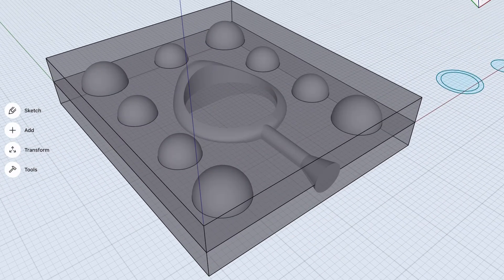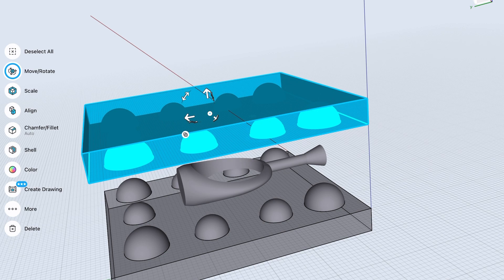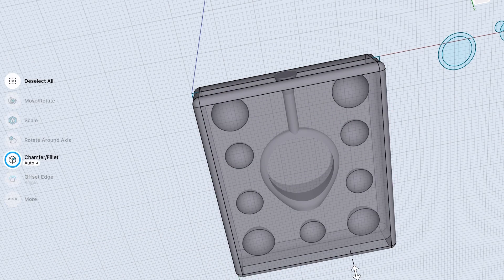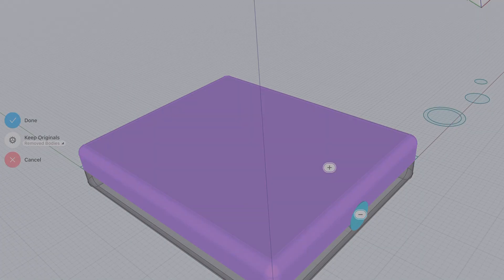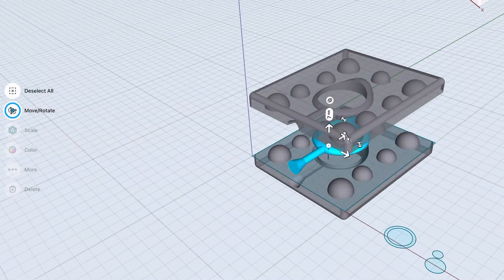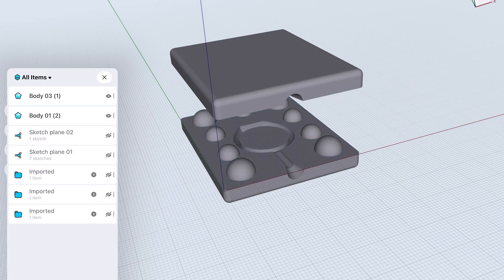You also wouldn't need to even have a master mold because this is all done digitally, so you can work with clients at a much greater distance without having to ship anything — which is getting much more expensive these days. You have total control over how the mold is built, so you could even run flow simulation tests to make sure there are no turbulent areas or bubbles before you even inject. A really big one especially for larger businesses: you could imprint each mold with information like client names, model names, variation, ring size, wax extraction instructions, and the wax factor. To some degree, being able to print just what you need without any extra rubber off-cut, mixing bowls, and mixing sticks for RTV is certainly a factor. Printing isn't flawlessly clean, but it's definitely a cleaner alternative.